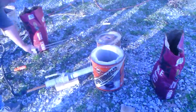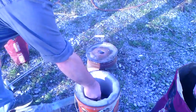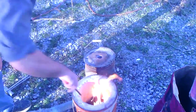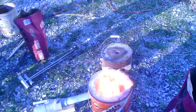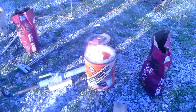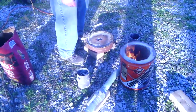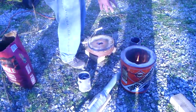This has probably soaked long enough. We're going to light it off. Let that burn, and when it catches real good, put a little air to it to get it going. For air source, a lot of folks use fans, vacuum motors, or blow dryers. This is just one of those cheap ten or twenty dollar air mattress pumps — it works pretty well for aluminum, though probably not hot enough for brass.